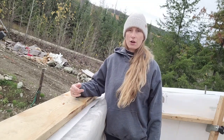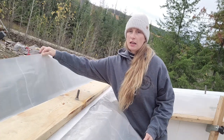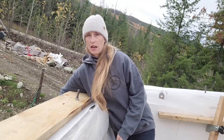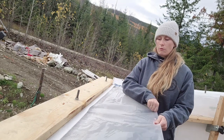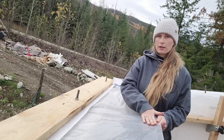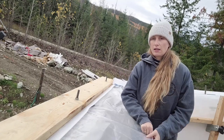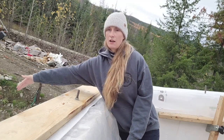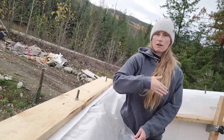For a passive house, essentially this piece of poly, the outside of it is going to be sealed to our outside house wrap, which is airtight, and the inside is going to be sealed to what most people would have in their attic underneath their insulation, but this is going to run along the bottom of our trusses the entire way. So that creates a completely sealed house from the outside, the ground, all the way up over our roof and back down the other side on all four sides